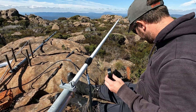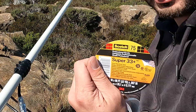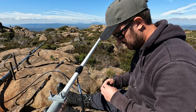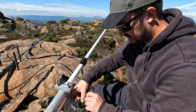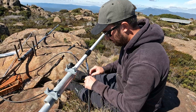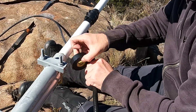The way we're going to seal this connector is I'm going to use some Scotch 33, Scotch 33 Super 33 Plus. So this is electrical tape. What we'll do is we'll do a layer of this first over this connector. We'll start reasonably far back and get all of the bushes out of the way. This is good, nice vinyl type feel tape, just electrical tape. So we'll go over that first.